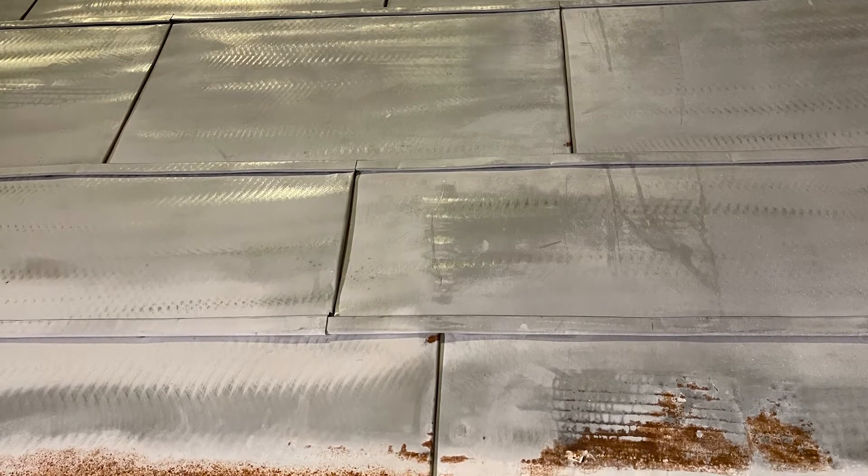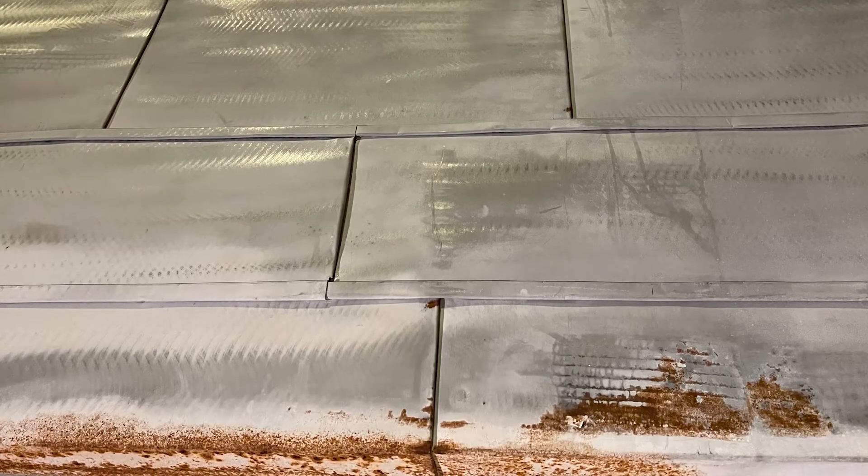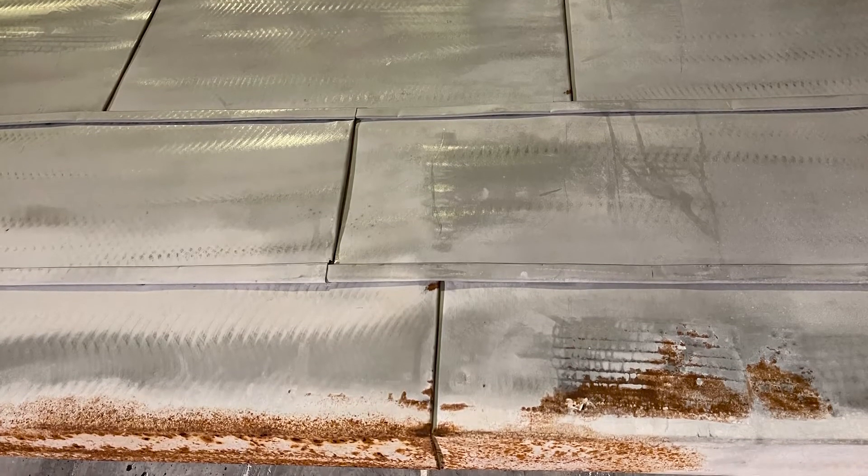At this point I must talk about galvanized sheet. Hot dip galvanizing is the process of immersing iron or steel in a bath of molten zinc to produce a corrosion resistant multi-layered coating. It can have all kinds of nasty stuff in there as well that helps the surface hold up to harsh outdoor elements. It is steel with a thin coating of zinc, so it fabricates much more differently than sheet zinc.